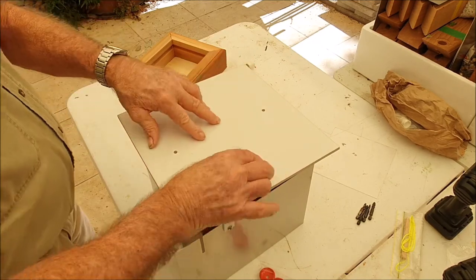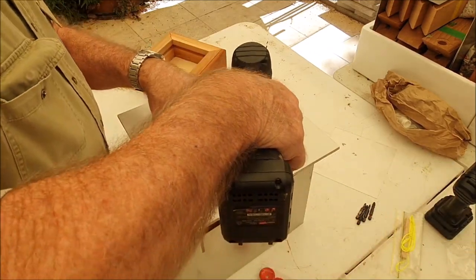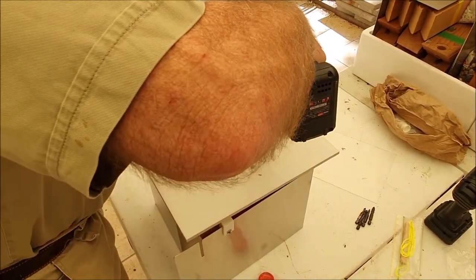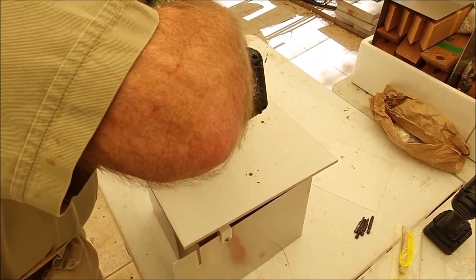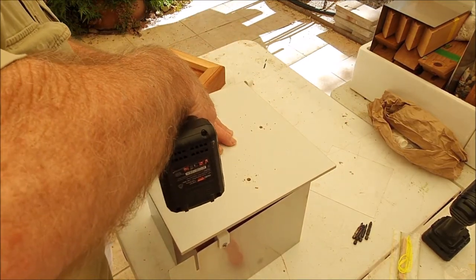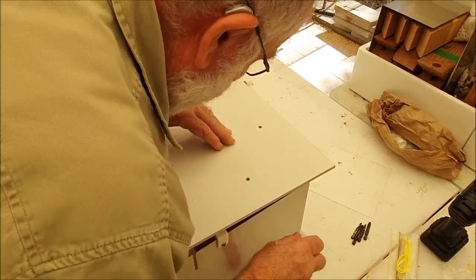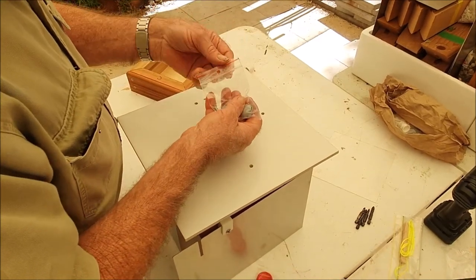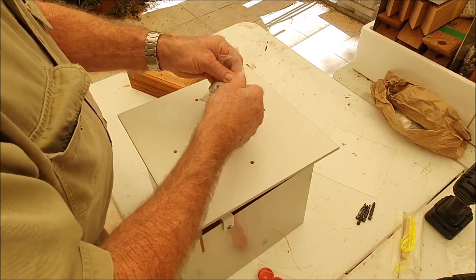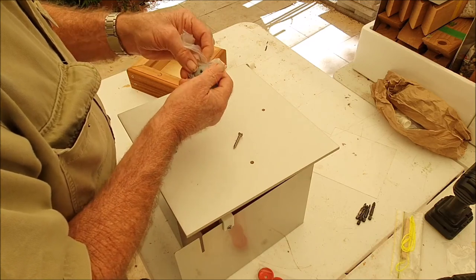To line up on those edges, and that makes sure that those four holes are in the top. Then I can pre-drill the tops. Now, if you're going to pre-drill all of them, just make sure you don't move that tile, and certainly don't rotate it. Because those holes aren't fixed positions, they're a unique position.